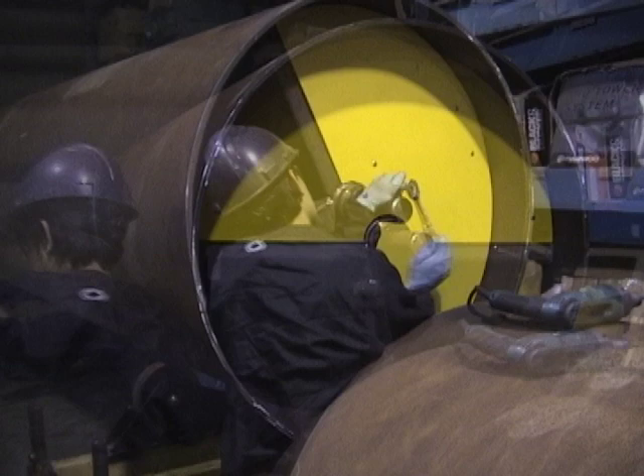This is a lot different than the one or two days spent trying to properly replace a welded shaft in the middle of a field. AgShield rolls are 42-inch diameter tubing. Standard wall thickness is 9/16-inch nominal with 5/8 available as a factory option.